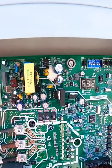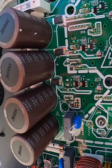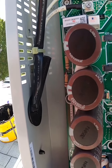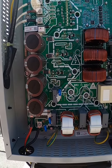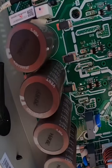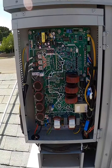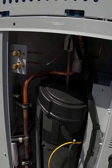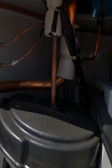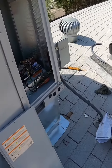The only thing that I am concerned about is these capacitors right here. On a new unit, it's going to have a breakdown at around year four through six, and that breakdown is probably going to be a bad capacitor. On a regular unit you could just swap that thing out and you're good to go, but on one of these you're going to have to change that whole board. The nice thing is that these capacitors integrated into that board are rated to withstand up to 220 degrees Fahrenheit, and that is plenty of heat.